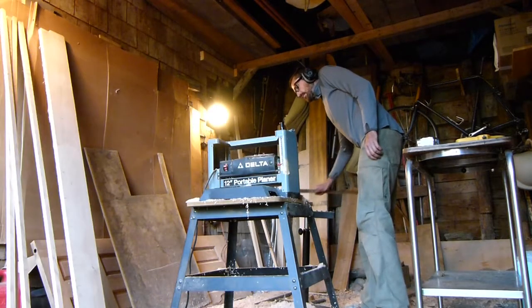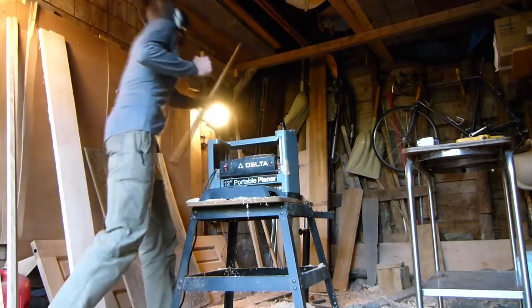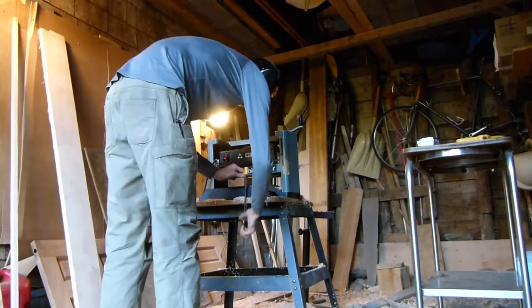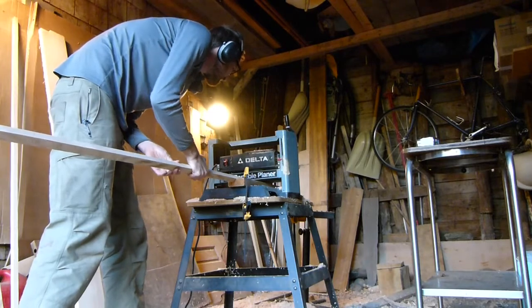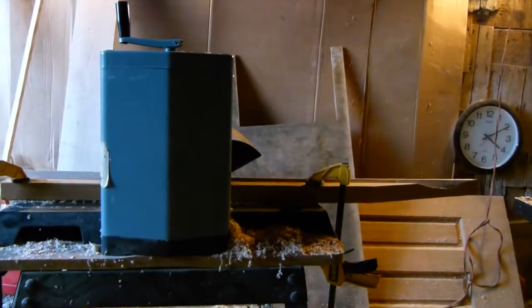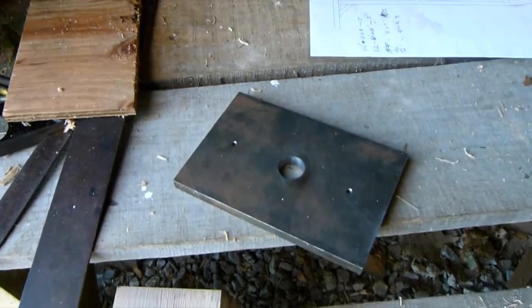Here I am setting up this peg-making operation. I'm making pegs out of the red oak that Billy and I milled. I run through and square pretty much a perfect one-inch square stock, and then put it into this little jig that I made. This is something Matt and his dad used to do to manufacture pegs for frames they were building. I cut that V out of a piece of cedar two-by-four and just feed this through over and over. That's a six-foot piece, and if you focus on the right, you can see it takes me about seven minutes to work through one.